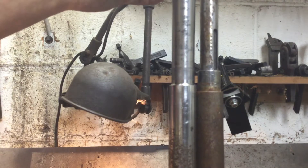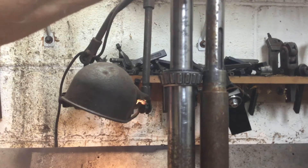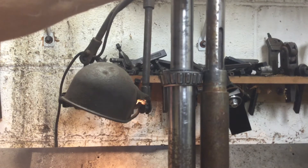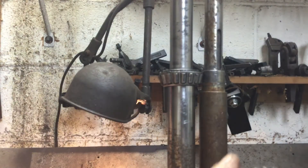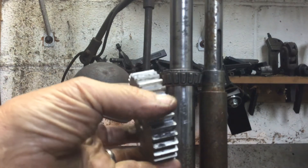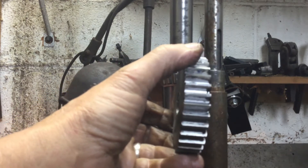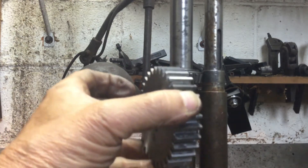With the new axles, the problem is that even though you have everything tight and the wheel is on it, if you didn't think to check for end play and just reassembled it with the disc brakes back on, you wouldn't realize it until driving — you'd get a little wear and the differential slides back and forth. Then the axle gear moves into the spur gears, trying to engage both at once. One is engaged and the other isn't, so it moves across and tries to engage the other spur gear going the opposite direction, and you break teeth. That's what I believe happened.